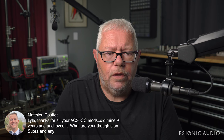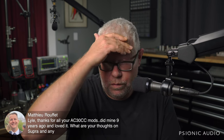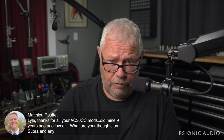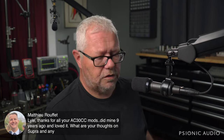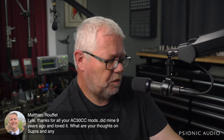Hey, Matthew, I'm glad that worked out for you. Yeah, those mods I put out on the forums for the Custom Classic, for those unfamiliar, were fairly basic stuff. It was like, take those 100K plate resistors and change them to 220K, because it's supposed to be a Vox, not a Fender.